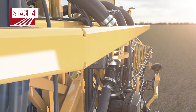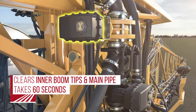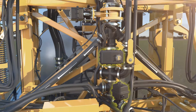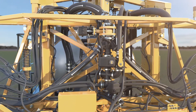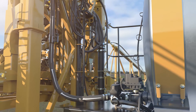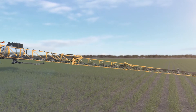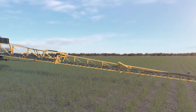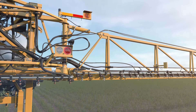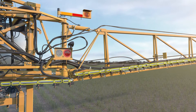Stage four finishes clearing the inner boom and main pipe assemblies. The main shutoff and boom feed control valves are opened and a new air path is established. The sump product recovery circuit stays pressurized. The operator moves the booms down to allow gravity to assist recovery in the main feed pipes, then the boom is moved up for product recovery in the inner and center pipe assemblies.